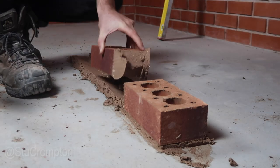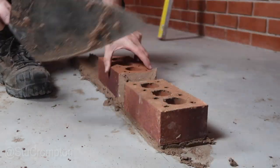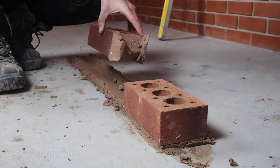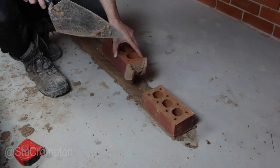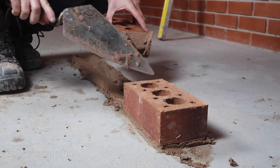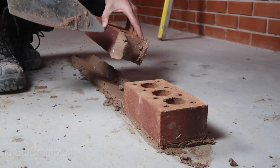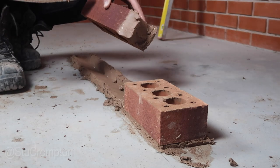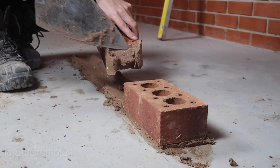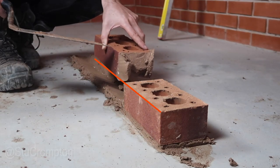Next brick now. We want to push that onto there, so we might have to hold with our trowel and just support that brick because we need a bit of pressure going into there. In bricklaying, you always want to work to what you've previously laid — we've set that perfect, so we know that's right. What we can do now is use the lines of this brick, which we know is perfect, to match them up with these as well. These are called arises — it's the junction where two faces meet, and that forms a sharp aris. So we'll match this aris up with that one.